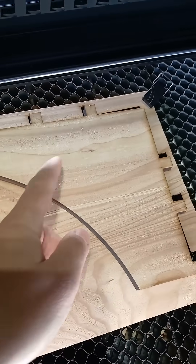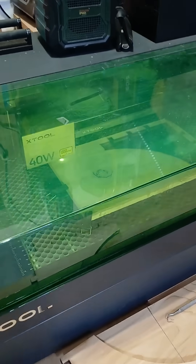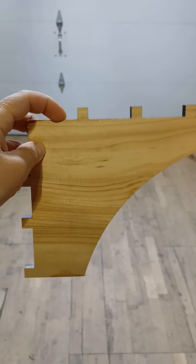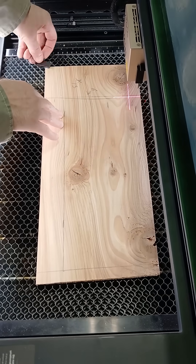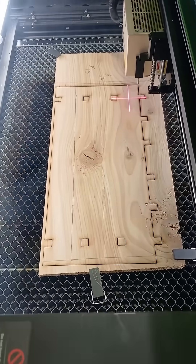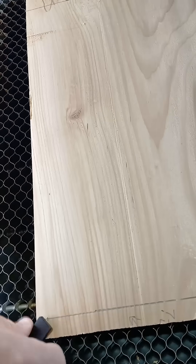The wood is about half inch thick and to get a clean cut we're doing several passes and lowering the focus with each pass. So the bracket here will fit into pieces cut out from the top as well as the back bracket. The cedar is quite flammable so you want to be careful so the wood doesn't go on fire when cutting with a laser. It is a bit smoky, especially with the first pass, then it clears up a bit.